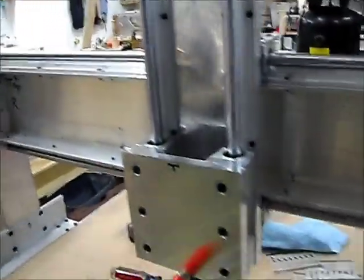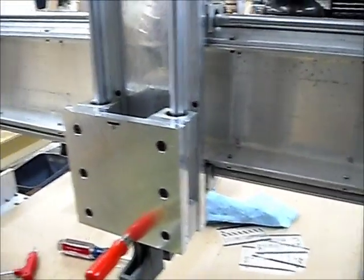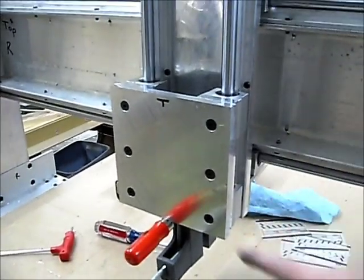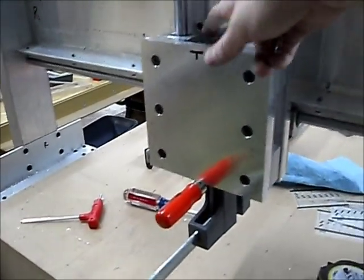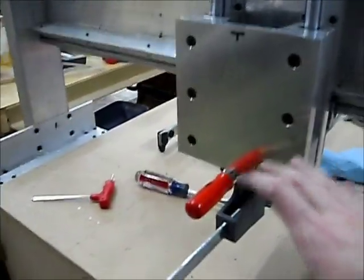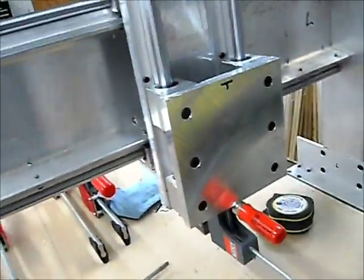It's a bit heavy. I might have to counterbalance that somehow — I'm not sure yet. But it's in, to which this plate is here, so I have one elaborately drilled plate. There's a bunch more holes I've got to put into this. I've got to make holes for the lead screw nut, the lead nut, and then I've also got to make place for the router to mount to and the router holder to mount to. Basically, that's my one plate that I'll only ever have to manufacture once.